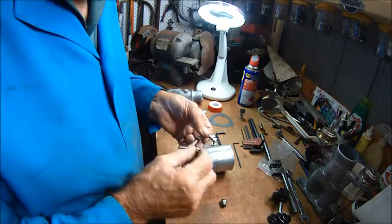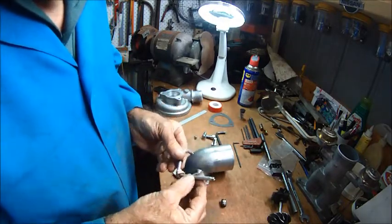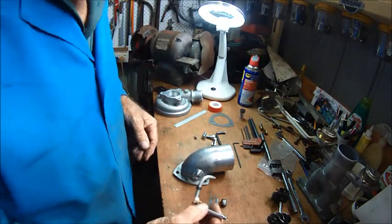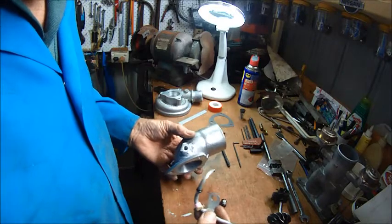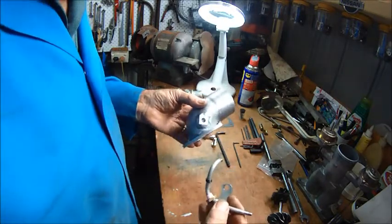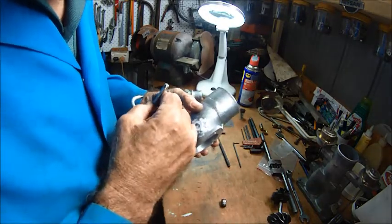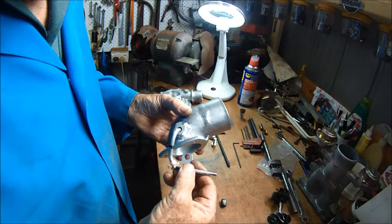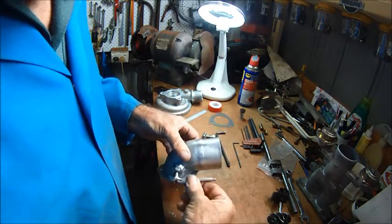I'll assemble and show you how all this is going to go together. This tube was all hand bent — a friend of mine has got a nice little bender and we utilised that. All this had to be made so that it could be assembled. You may see in here this was drilled out, but this is quarter tube — that inside one is just above quarter so that it can fit in and go around the corner.